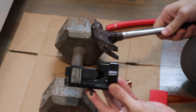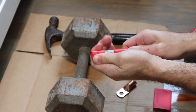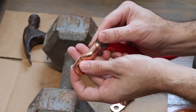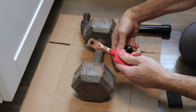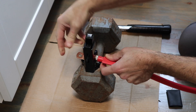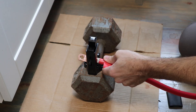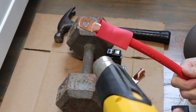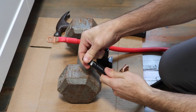We do this the manual way because it's just way cheaper to buy one of these crimping tools for a job that we don't do that often. All you need is a hammer and one of these — I'll leave links in the description below. What we're going to do is slip off the insulation on the end and feed this in very carefully because this is fine-stranded wire. Once our lug is on the end of the wire, we put it in our crimper, get it seated properly, and hit it several times with the hammer. Make sure you've got a hard surface below it. Now we can put on our heat shrink.